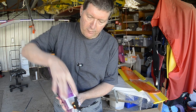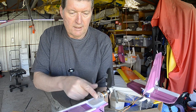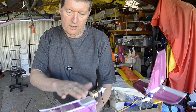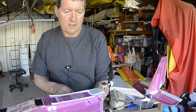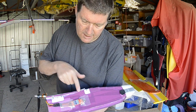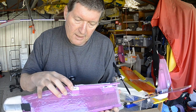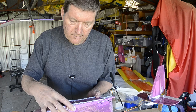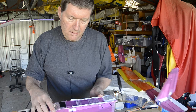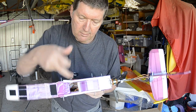I've left the top deck full width to give more for the motor to mount onto. The motor mount is aluminium bent up into an L shape, with double-sided tape onto an ID card which is hot glued onto the top of the fuselage. The ESC just runs around the outside for ease of access and cooling. The wing tie-downs are carbon fibre rods, reinforced with ID card plastic where they pass through the foam. And I have a little hatch just for access to the receiver.